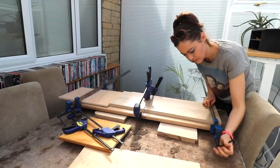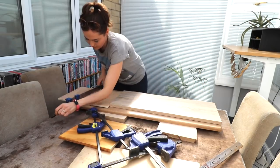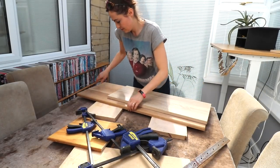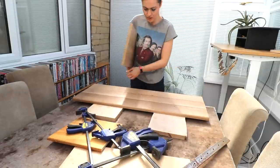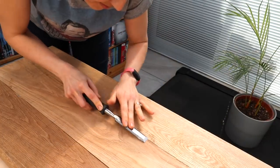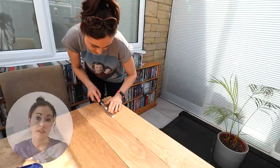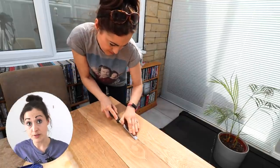This is how I left it overnight. Although I've got planks underneath and on top with clamps, I still think I could have done with more. After unclamping, I didn't notice any bowing at this stage. It just needed sanding and filling some of the joins. It might not have been completely dry at this stage, and I removed any dry glue I could see with a bluntish chisel.